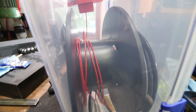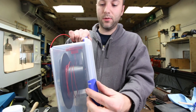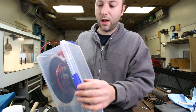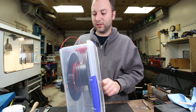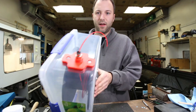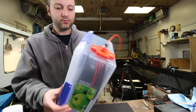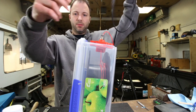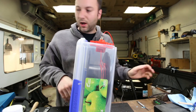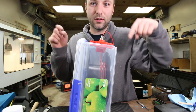I didn't design it, so I think the guy who designed it obviously had a British pipe thread tap and could just start that and work it in from there. I think it's going to work — obviously a little bit more of a battle. I had to add this little reinforcement piece; I know it's not straight, but this should help reinforce it and cover that crack up. If you have any better suggestions for these containers, let me know. In general this is a pretty good size and I was happy with how it packages in the cabinet. It's got these positive snaps and a seal inside — everything about it I thought would fit pretty well. Anyway, I need to fit the tubing in the printer location — on to the next adventure of trying to print nylon. It should be fun — consider subscribing.